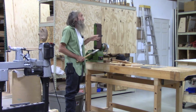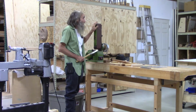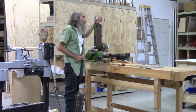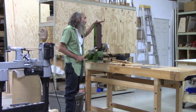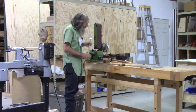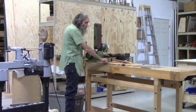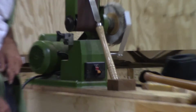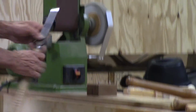John does all of his tools, or did all of his tools, with this particular style of jig. Usually a very worn 150 or 220 grit belt is what I have on here. The block setup that I have just allows me to move to different angles so that my bevel always lays right up. So it's a 2-second process.